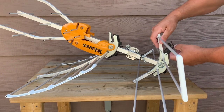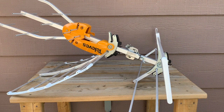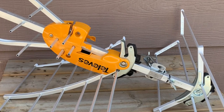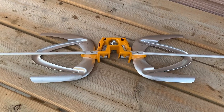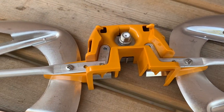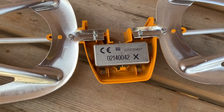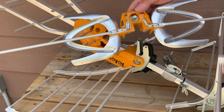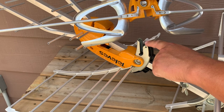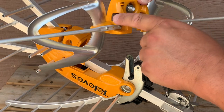You can install the bottom VHF reflector the same way as the top reflectors, but before you put in the bottom UHF reflector, it's best to install the active element first so you have a little more room. The active element that captures the TV signal has both UHF and VHF elements on it, along with an RF connector for the coax cable, a preamp chip powered by an external power supply that is also included.